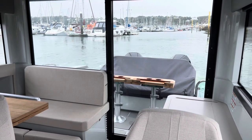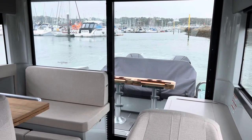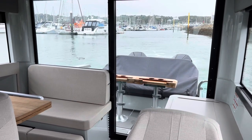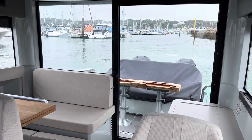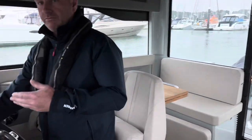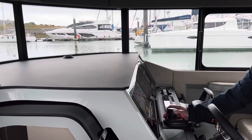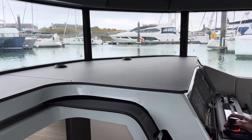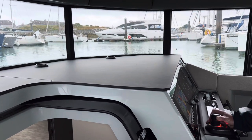At this present moment I'm going to put the boat into sideways movement. As I go sideways, there are factors that will make me not go true sideways — for instance, if I have wind on my bow, the bow will push over to one side, so you can correct that. I'm going right with the joystick now. If I wanted to turn my bow or stern, I turn the joystick and we continue to go sideways but the bow will turn.